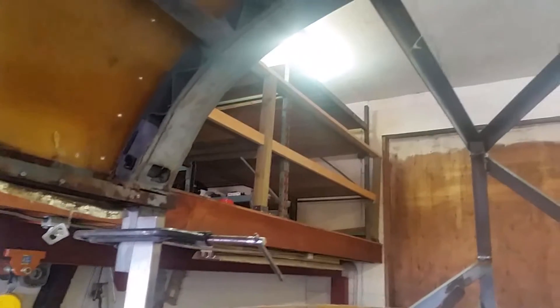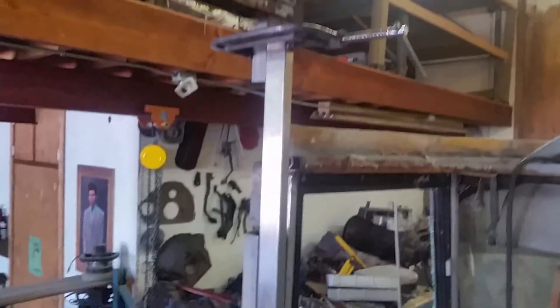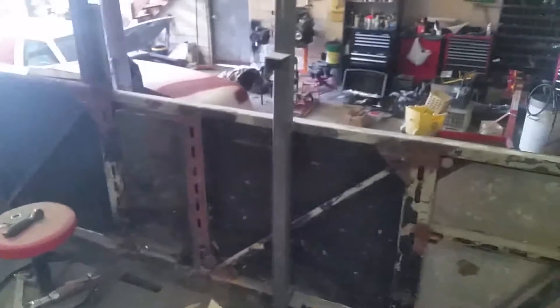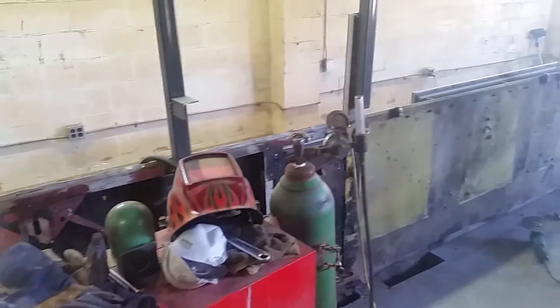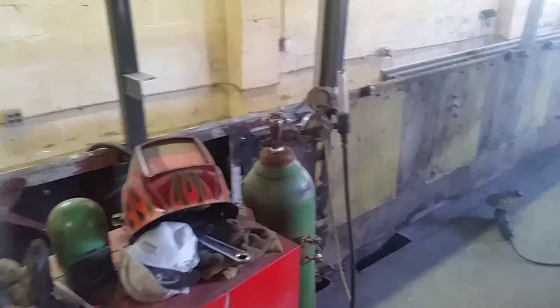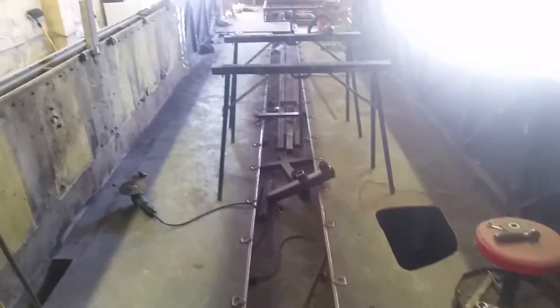The cap's ready to go back up, so we'll put that into place. There's a little bit of filling to do up here yet — all these holes — but I'll get to that. Once this is in, I'll get more steel next week and then I can start framing in the slide-outs, once this is all supported at the front nice and solid. Then I can go ahead and cut all this structure out and do the framework for both slide-outs and the entry door.